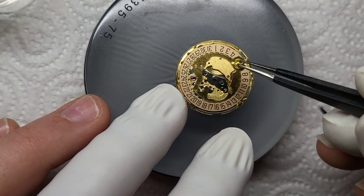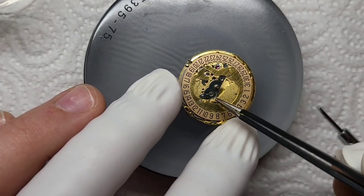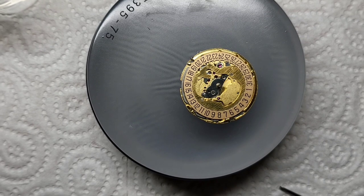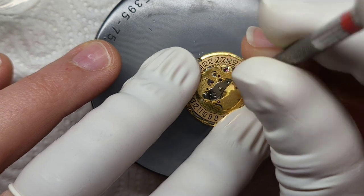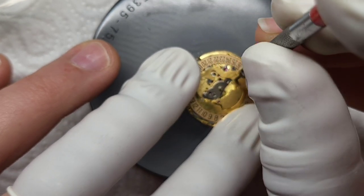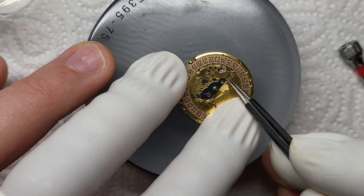We've gained access to this cannon pinion with a thrust washer on, which we're very much used to seeing from the pocket watches. The difference between a watch like this and a pocket watch is all a sense of scale. Although there is a lot more to it, in essence they are one and the same — a big spring going down a train of wheels to an escape wheel, a pallet fork and a balance wheel. The additions are all called complications. I have the vision of a watchmaker sat moaning about these new complications after doing the job for 60 years.